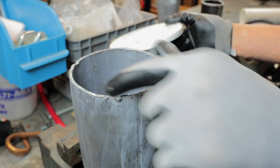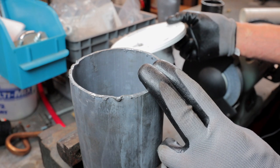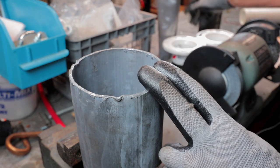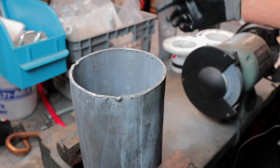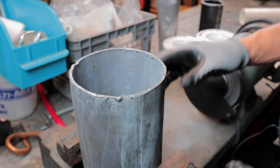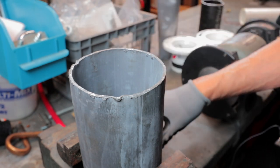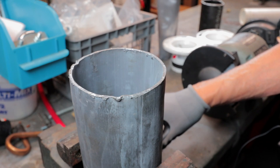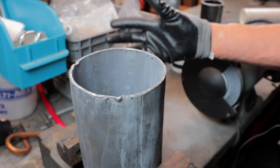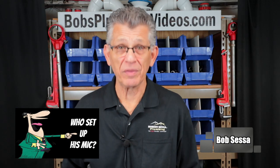So as an alternative to soldering lead, bear in mind the actual lead in the field won't look this good — this is a brand new excess piece I cut off an existing lead bend I installed. But guys, this is a great thing. I'm putting these two items in my truck, and the next loose toilet bowl call I get, if the lead bend is viable, I'm going to use one of these flanges and save myself the soldering, the candle, the torch — the whole thing that goes along with soldering.